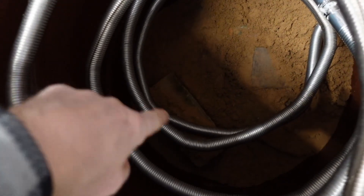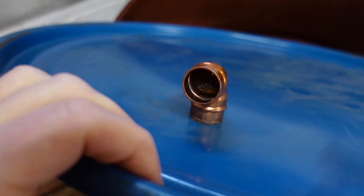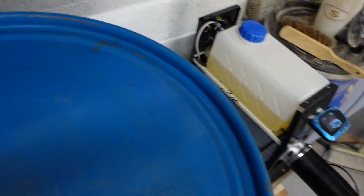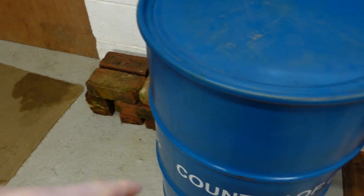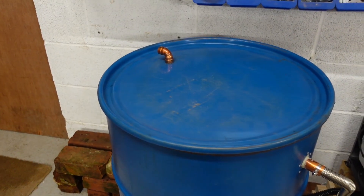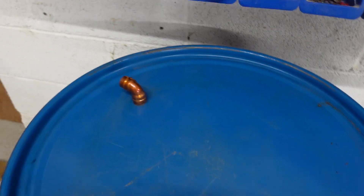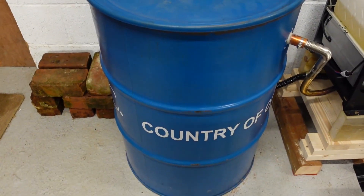There's the story so far - you can see down there there's a brick, there's another one. I'm going to build this up in layers because I don't want the pipe to drop and form a dip when it gets warm. I figured putting some bricks in might help the stability of the sand. I've also added a vent, which is just a 22mm elbow with a straight connector soldered through - I'll chop it off because it doesn't need to be that long. That's just so this can't pressurize; the bricks are damp and the sand is definitely wet. I want to get as much moisture out as I can, but rather than this thing trying to blow up like a balloon, the vent should let any pressure and moisture out.